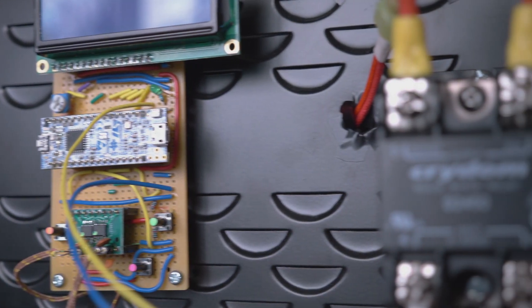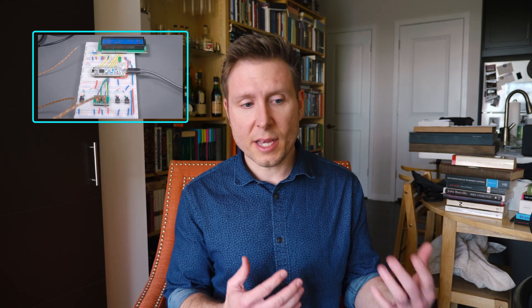For the controller, this is the same controller from before. In a previous video about thermocouples and thermocouple ICs, I communicated with those and read the temperature out to a screen — that's the foundation for this controller. We read the thermocouple temperatures, send that data back into the controller, and ask: do we have to turn the heating elements on, or is it getting too hot and we should turn them off? When I want to actually turn the heating elements on, I send an on-signal to a solid-state relay mounted to the outside of the toaster oven.